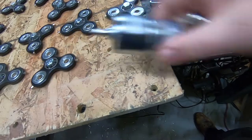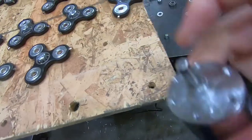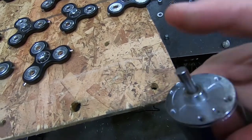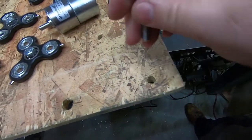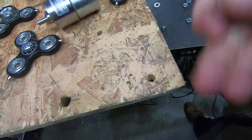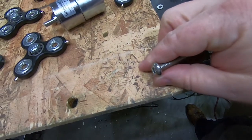And then once the motor is mounted under there, it'll have an adapter on here. So it has a nice set screw for the flat, and the other side will be tapped for 5/16-18, and then this whole unit can be threaded down in there. And as long as the motor's turning counterclockwise, it can't unscrew itself. And there's no torque here anyway, very low power. So I think that'll work fine.